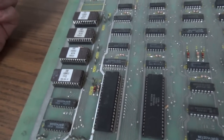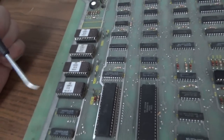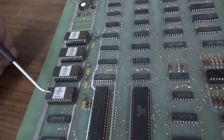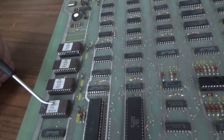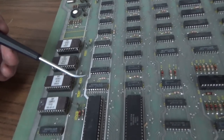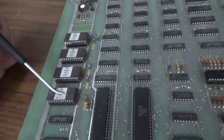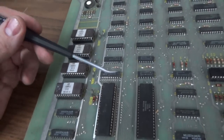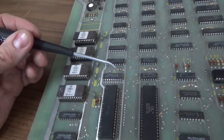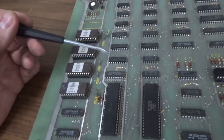All right, folks, so the problem we're running into is the chip is trying to access the ROM. I believe it's D1 that it has to get first, which is chip 307, the software number. So it's trying to access one of the chips, and it needs the buffer to have the data travel between the two. I think there's another chip involved as well. These two buffers are doing their thing with the address lines. Everything's doing what it should. The data buffer isn't doing anything, although there are three inputs that are pulsing, but the chip itself is not turning on or any of that.